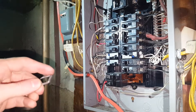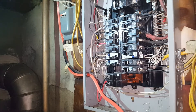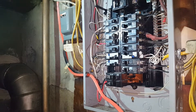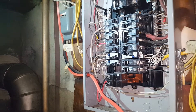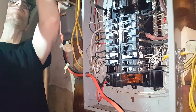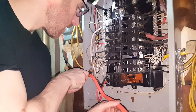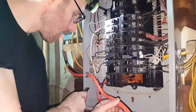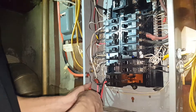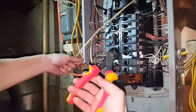While I'm here I may as well hammer on these insulated tacks that tack on cable. I have it going through the joist but it also should be supported somewhere, so I'm going to support it on the side of the joist with one of these little insulated tacks — not too much coming through, just a little bit.